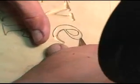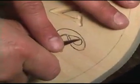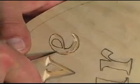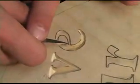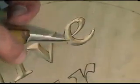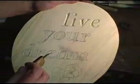E's and A's are probably the toughest letters to carve. O's are even better than an E. So more than likely I'm not going to get this to come out as a single chip. That chip is going to come right out. Don't pop the inside of the E out, so be careful, don't get confused about what chip you're taking out and which one you're leaving. Okay, now most of the E is out. This is a little bumpy in this area, so I'm going to make a finish pass. Much better. I'm happier with that one.